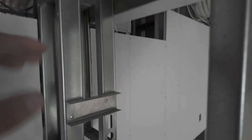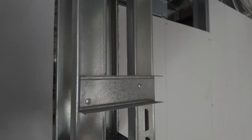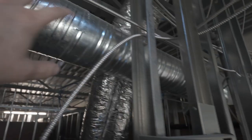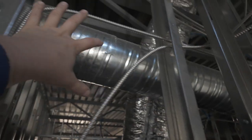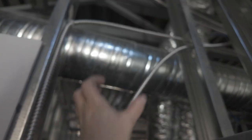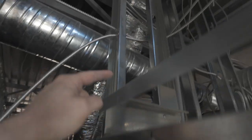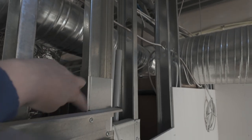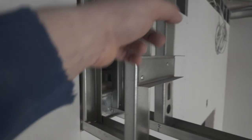I'm adding braces in between so the studs don't move at the bottom. Behind here I put a clip - what I mean by a clip is a piece of steel stud cut to fit in between the studs, which you screw the stud into and then come off with bottom track. Some places where the steel is running the other way I cap it with track so I can screw whatever I need onto it. Simple as that - do the back bulkhead first, screw it front and back all the way so it's super strong.